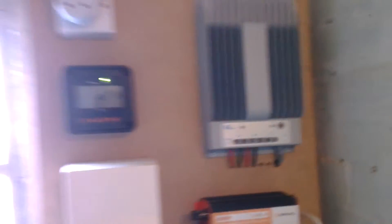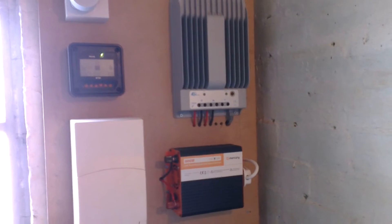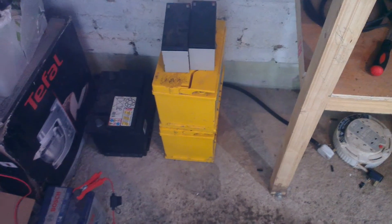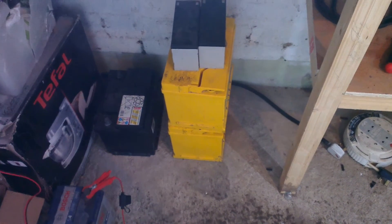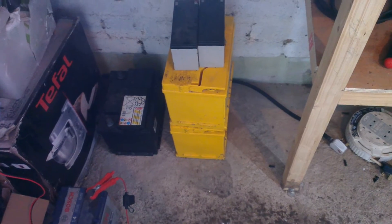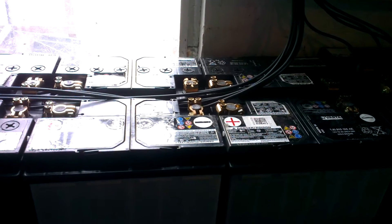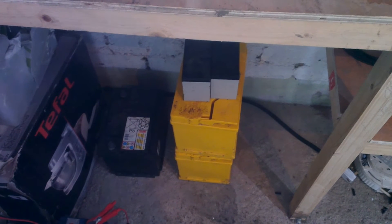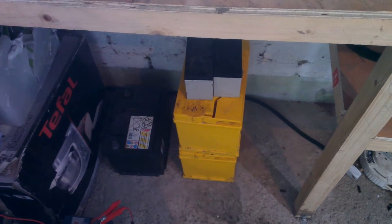It's been running over the past few weeks with no issues really at all. In the last videos I had these yellow batteries here - well, one of them I can't seem to bring back to life. One of them is now as good as new as far as I can see, but the other one is pretty much dead with some shorted cells in it. So I needed to remove the two yellow ones because you need them both working together to make a 24 volt bank, and since one is dead I can't do that.